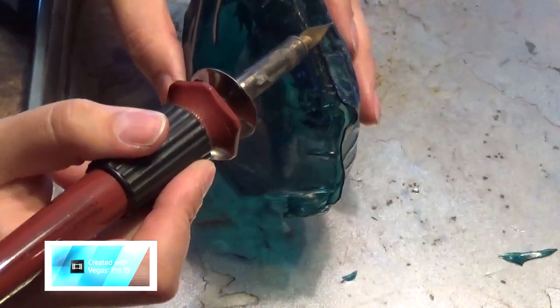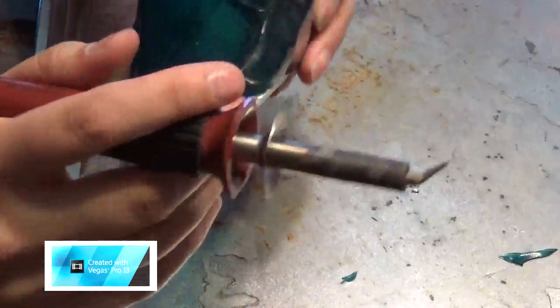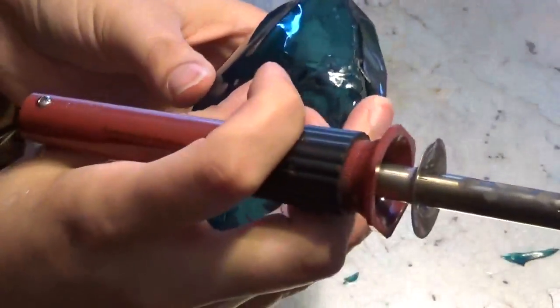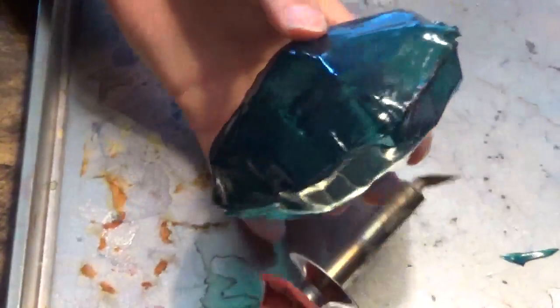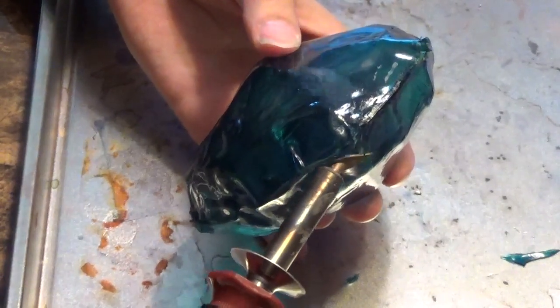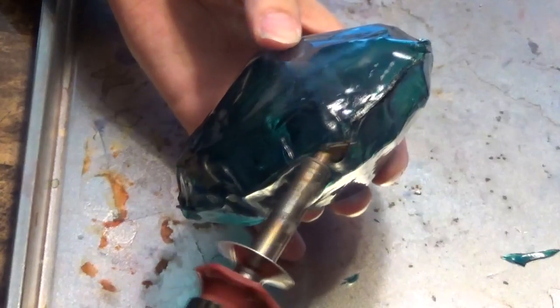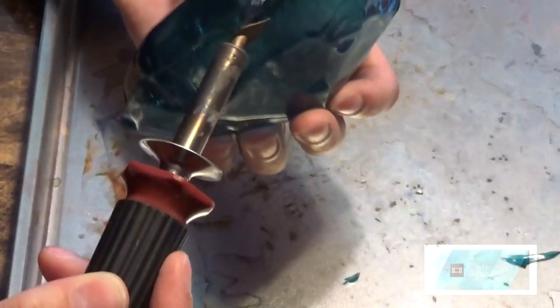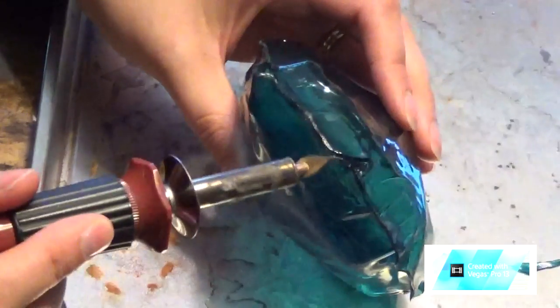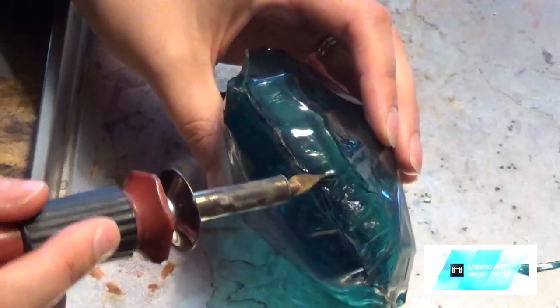We're going to take our time here and start with just one edge at a time to melt them, find a set of edges that will line up nicely, and go from there. You want them as flush as you can manage — they don't have to be perfect right now, we're more looking at the angles. Make sure the angles line up and then we're just going to go ahead and melt this thing together. I'll be putting it straight flat on first to get it melted, and then go in at an angle to flatten my seams down. I'm going to warn you — this smells really terrible. You're burning plastic, so make sure you have a well-ventilated area.